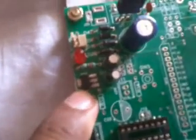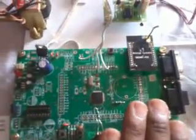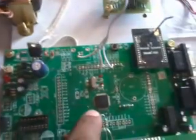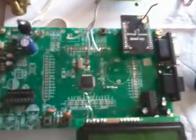So that's why we have another regulator, the LM1117, a fixed 3.3 volts regulator, which converts 5 volts to 3.3 volts. Actually we take the 9 volts and convert it into 5 volts: 5 volts for the LCD, Max 232 and the heartbeat sensor. After that, the LM1117 gives fixed 3.3 volts for the ARM processor, the Zigbee module and the temperature sensor. These all work under 3.3 volts. So that's why our board has a 5 volts power supply as well as a 3.3 volts power supply.